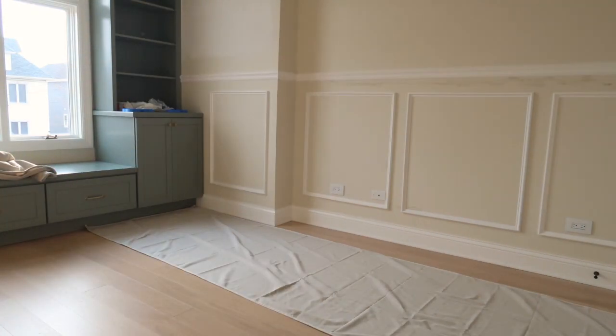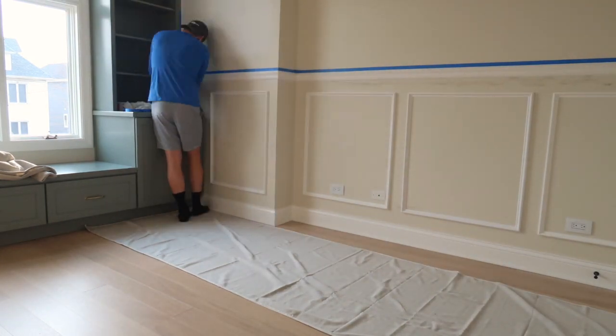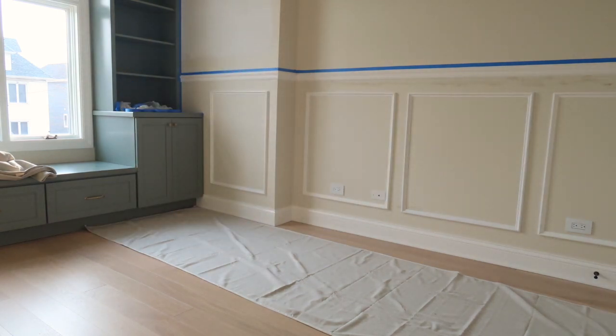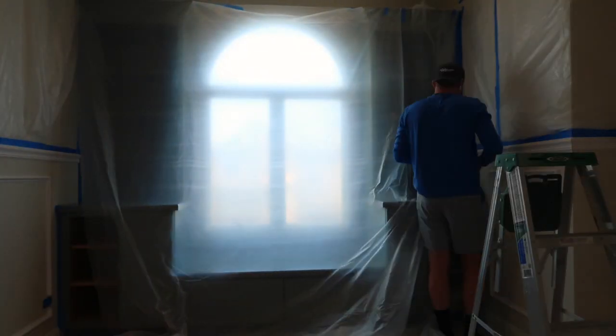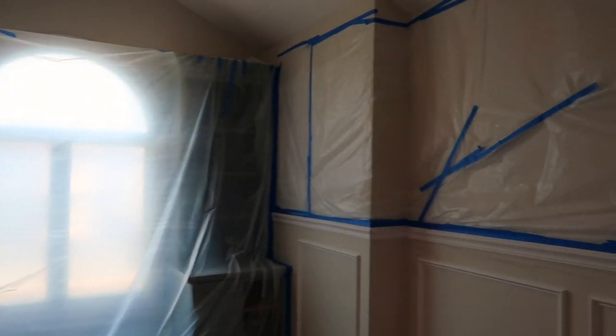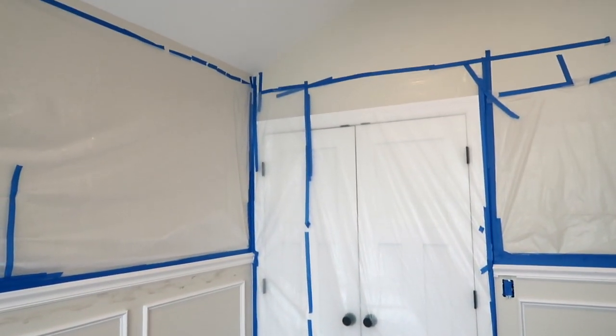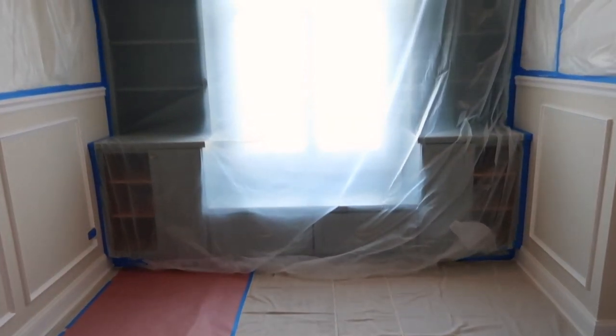Finn takes over the rest of the project from here. He is a huge fan of our new paint sprayer, so instead of hand rolling and brushing, he will spray the chair rail with primer and paint. This means a lot of prep work — he carefully tapes off the floor, doors, built-ins, really anywhere that we don't want painted. This takes a while, but it's so worth it because the painting part is then really, really fast. He's spraying because it's amazing, it's fun, it's super fast, and you get to wear a cool little suit.